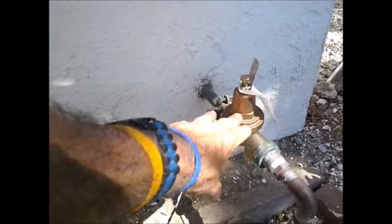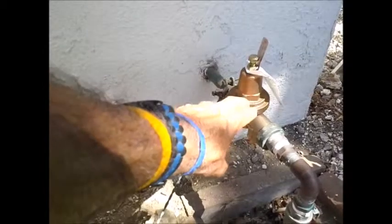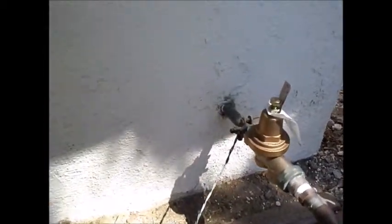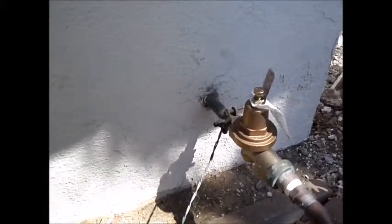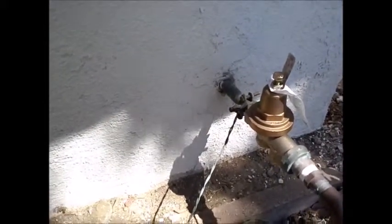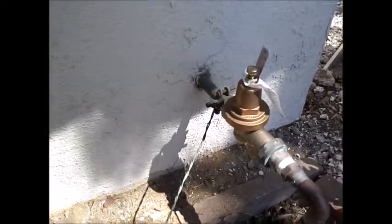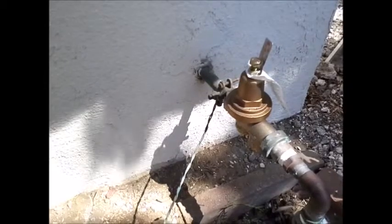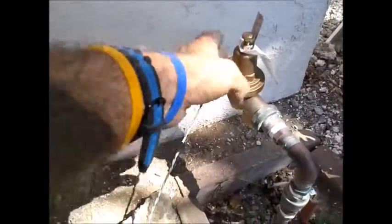And this is a pressure regulator, and the pressure relief valves are on the back side of the house. This is fine. So this is a new one, so we'll still test the pressure. Our street pressure here in the valley now runs about 140 to 160 psi. Our plumbing fixtures, toilets, sinks, are only rated to 80 pounds. So that's why we like to have these pressure regulators.